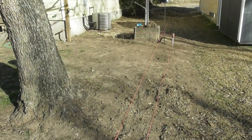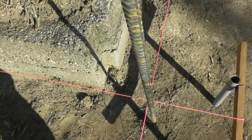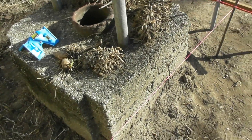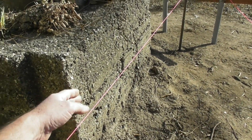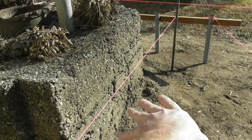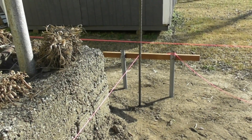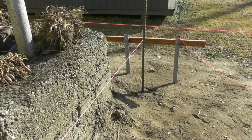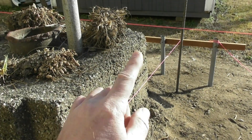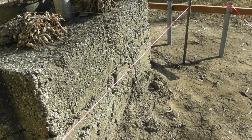Up in this corner, there is some odd stuff going on — again this is where this post is going to sit right there. I've got this weld in the way. I've been entertaining tearing it out, but I don't have time. I've got just enough room for my stringer and the picket to squeeze in here, but I can't nail it. What I'm going to end up doing is temporarily putting on the stringers, setting some random pickets across to keep things in line, leaving one off, nailing all the way past here, releasing the stringers, sliding it out, nailing it, then sliding it in and attaching it back. Not ideal but that's what I have to do.